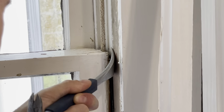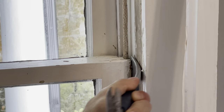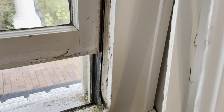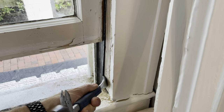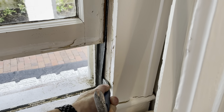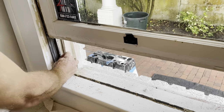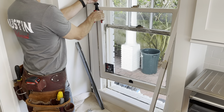Once you've got one side cut off, do the same on the other side. They may be hard to see, but they are always there — this is what holds it in place. There are not always nails at the bottom of the weatherstrip, only occasionally. In this case, I'm using a five-in-one, or you can go back to the trim pry bar to get it out just enough to pull that nail out. This one I can just pry out because there's a little wiggle room. Then pull the weatherstripping up and off of the bottom sill weatherstripping it's attached to.